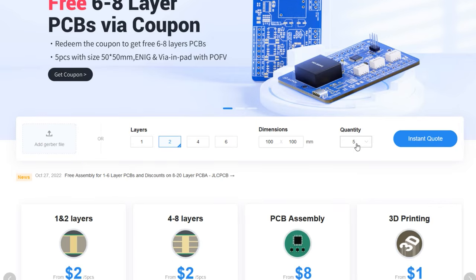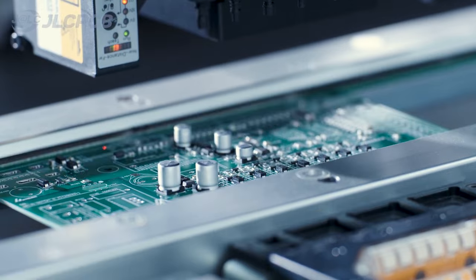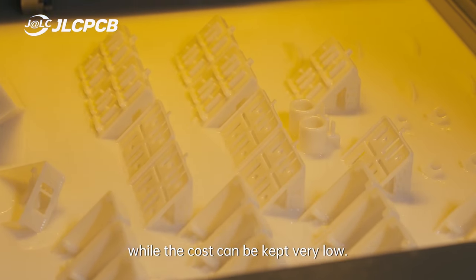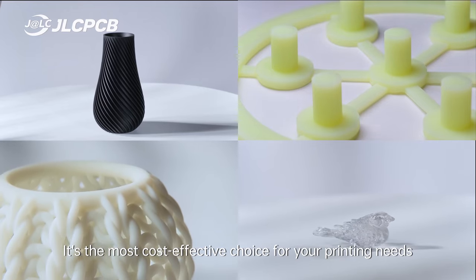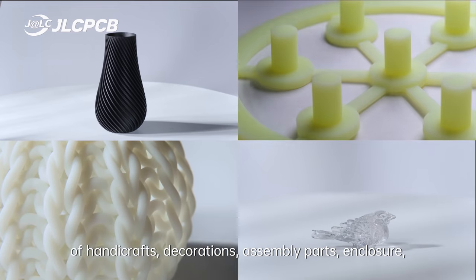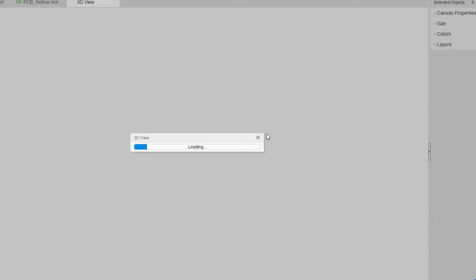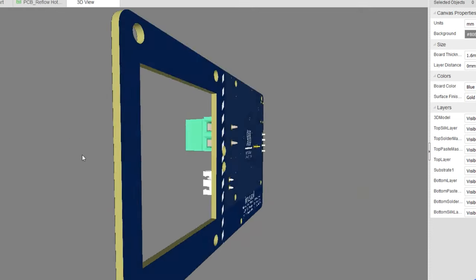Next is designing the PCB to integrate everything together. This is also the perfect timing to mention the sponsor of this video, JLCPCB. They provide high quality PCB and PCBA services suitable for prototyping or production projects, as well as 3D printing services — so if you want to make a prototype with good casing, you can use both services from JLCPCB. Check out the link in the description for more information. When I designed my PCB, I left a hole on the right-hand side to make sure heat from the MCH hotplate doesn't get absorbed by the FR4 PCB below, preventing it from expanding and cracking.